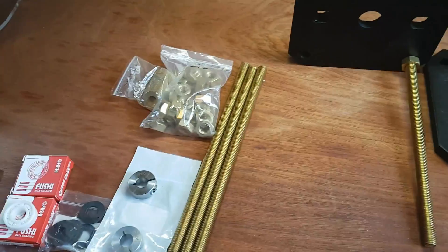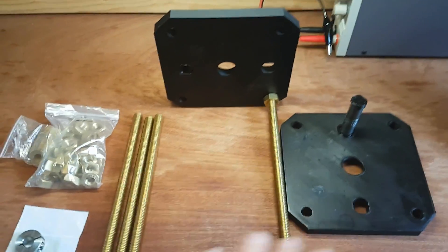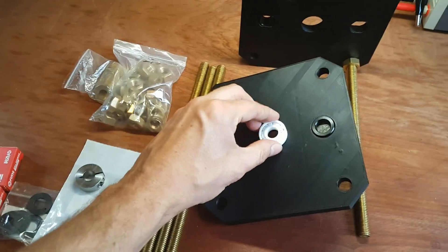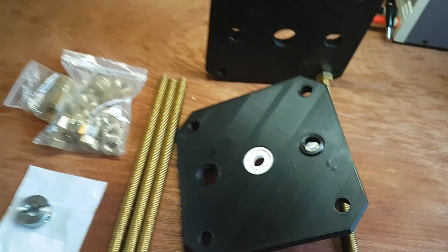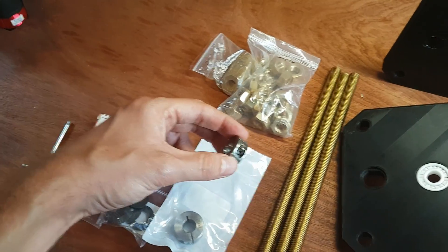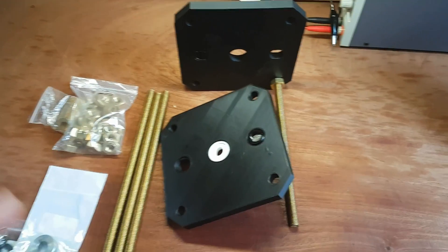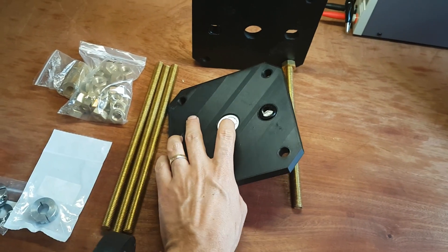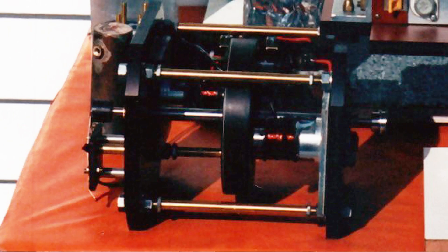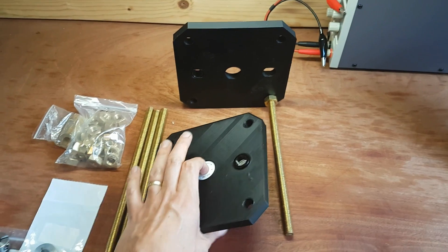Here you see the rest of the parts. There will be four brass rods to connect the two side panels. There's an opening here to fit the ceramic bearing — the bearing fits in there — and then there'll be a washer and a shaft collar to keep everything in place. It's a very nice construction. I copied this pretty closely from what Adams was doing, from pictures I had thanks to Peter Lindemann.